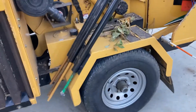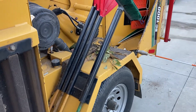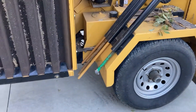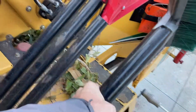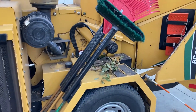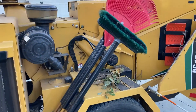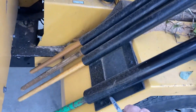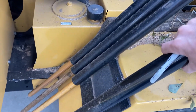The next upgrade is our tool carrier — a rack for our rakes, shovels, brooms, whatever you want to carry. Extremely handy. I'll caution you to be careful about your length so that brooms or rakes don't wind up too close to the ground. We've snapped off handles in the past, so we made slight adjustments. This is just round tube steel, layered to hold our rakes. If you're going on the highway, DOT is not going to want to see those on the side of the machine — throw them in the back of the box. But for residential around-town work, these are fantastic. The guys can grab them quickly and you can do a quick look to make sure you've got all your tools. We powder coated it and used a piece of rubber to keep the steel from rubbing together and prematurely rusting — this one's been on there four years with no rust.